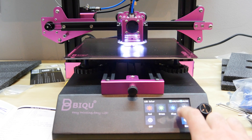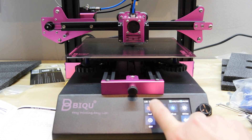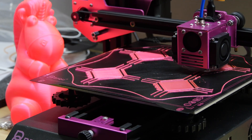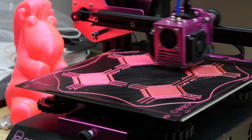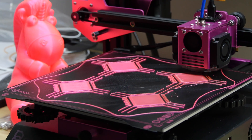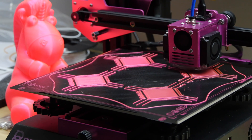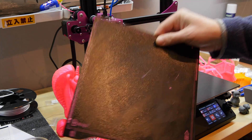Let's talk about some of the features specifically on the B1. First off, it is an Ender 3 version 2 clone — in that respect, it's entirely unremarkable, and there's nothing particularly unique that this iteration brings to the table. It does have an RGB light in both the printhead and the dial on the interface, which is great for checking on a print at night. The print bed isn't huge by any means, but at 235mm squared by 277mm height it's certainly big enough for most people. It's also a heated bed — again, fairly standard — and the so-called super spring steel plate is removable.